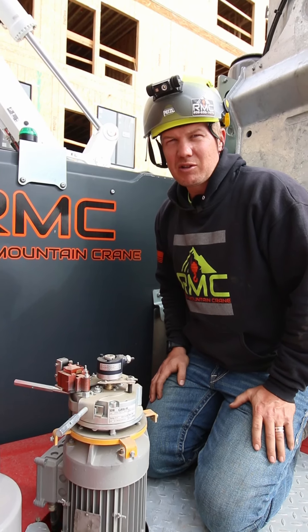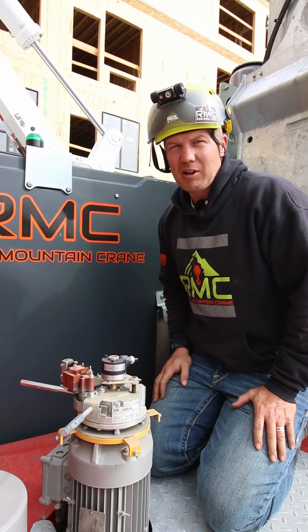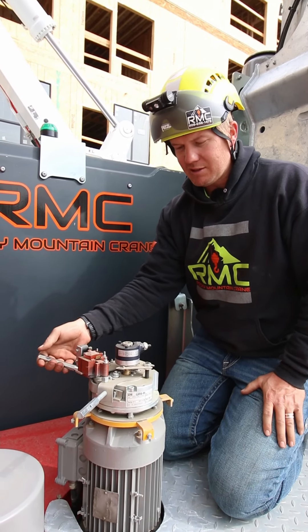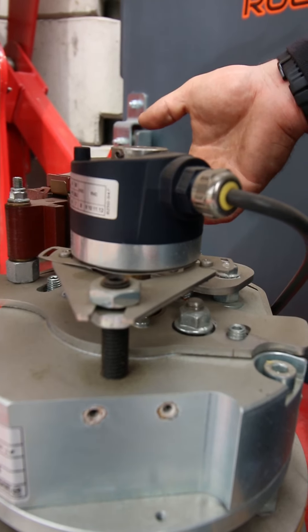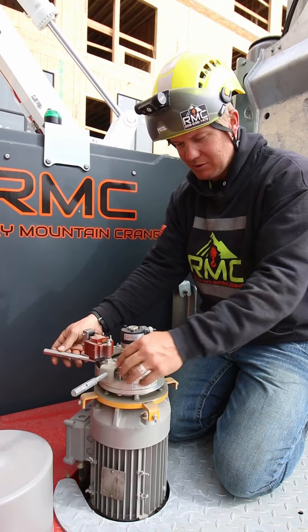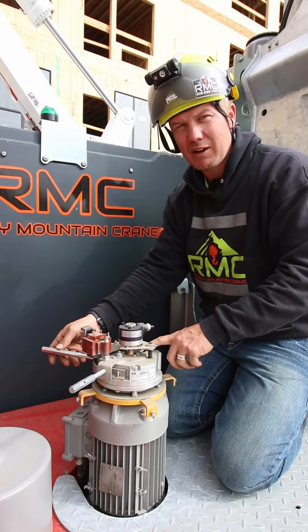You want to make sure that it is physically coming out of weather vane. We'll also show you how to manually put it in weather vane. On the back of the motor, you have the brake release. Make sure you're pointing downwind, then lift up on the brake and slide over the locking mechanism. That's going to slide this plate underneath these two nuts, hold the brake released, and keep it in weather vane.